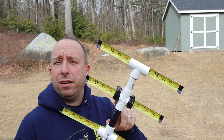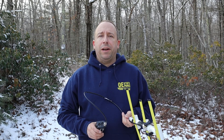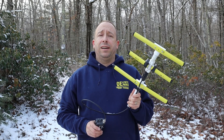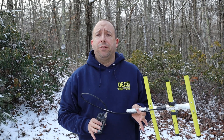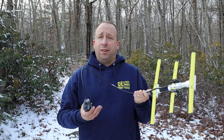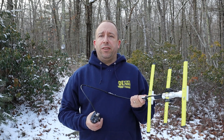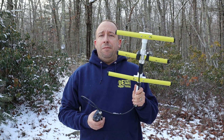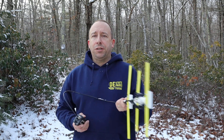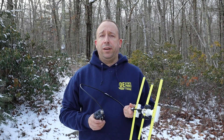I do have another video detailing this antenna a little more — if you want to see that, check the link in the description below when you're done with this video. The first unconventional thing I can do with this antenna is to simply try and receive a two meter signal with it. That's unconventional because this antenna is cut for 70 centimeters. It'll still work and receive the signal if I'm close enough, and it'll still be directional — it just won't be very strong.